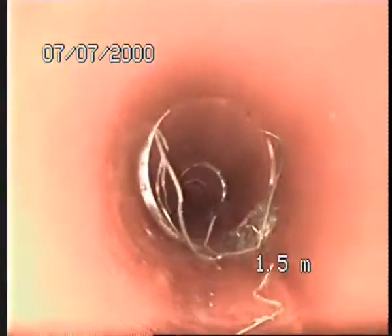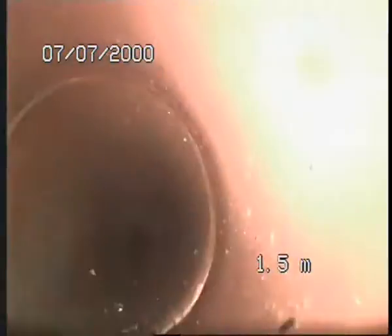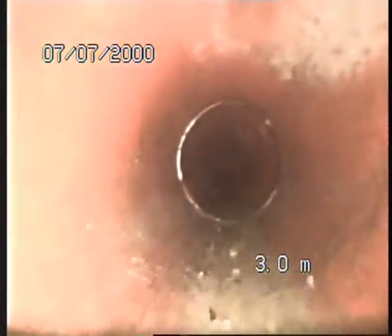What I'm going to do is push it upstream. We know now it's all clear all the way to the main — that's the pulling part. I'm going to push it towards where the bit of hose is. You can see the jet flusher hose — push the head upstream and see what's causing the blockage.